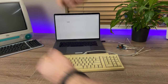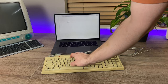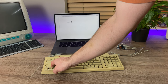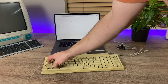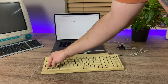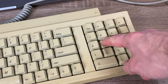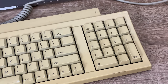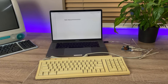Amazing! I've got no idea why it didn't work for the Mega — if you have any idea, let me know in the comments, because as far as I'm aware it's completely compatible with the Uno. So after testing every key, they all work apart from 5, 2 and 0, and as they're all in a line, there's a good chance there's a bad trace. I'll take it all apart now, give it a good clean, and see if I can see anything wrong with those keys.